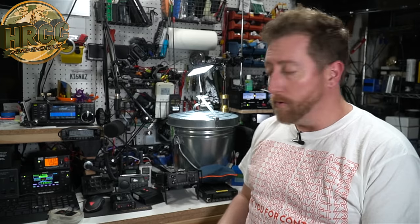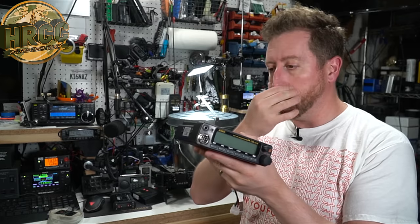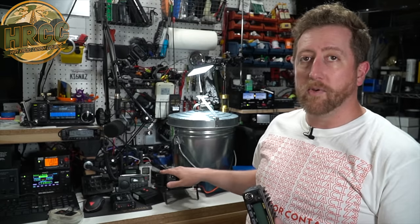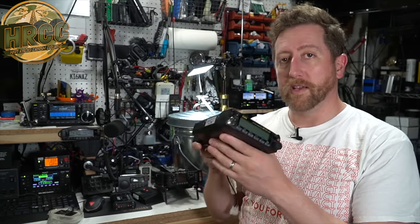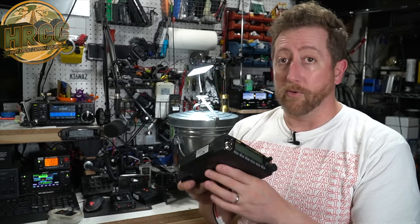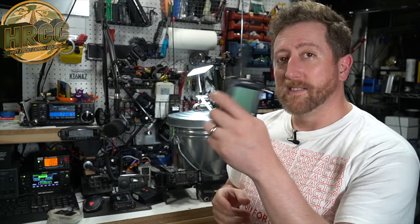My alternate for that would be my 2 meter packet radio solution using the Raspberry Pi as the TNC basically, and the brains that would encode and decode the signals for 2 meter packet. With 2 meter packet, we're not going to get the greatest range you could get with HF, but we'd still get out there and we would be able to hop through nodes and establish communication that way. Effective communication, really useful communication because it would be over VHF. And if we could establish a long line node connection, we'd be able to transmit information back and forth very easily. Now the contingency in this case is a lot to desire, right? There's only so much you're gonna get out of this. The contingency in this case would likely be APRS. Now, APRS, this is a second radio that does APRS.